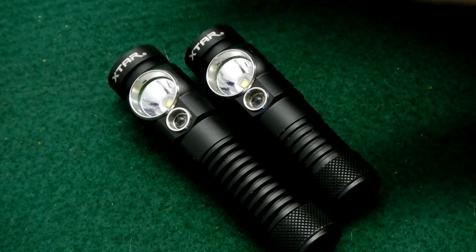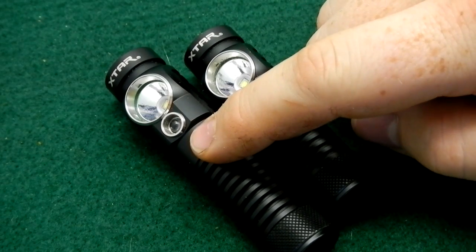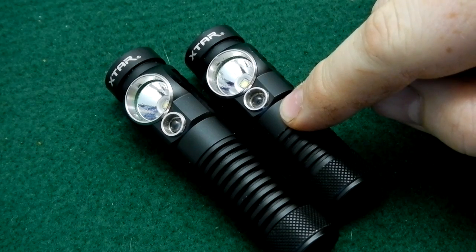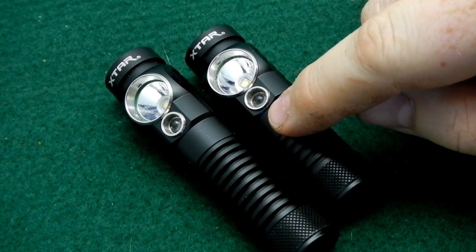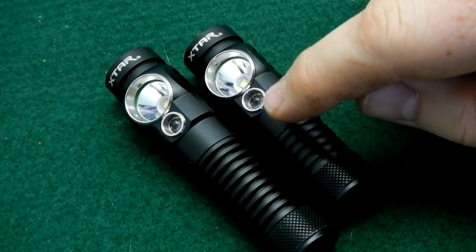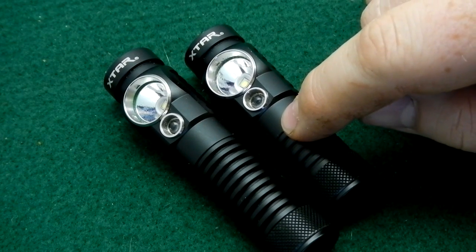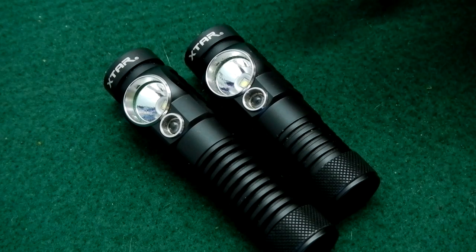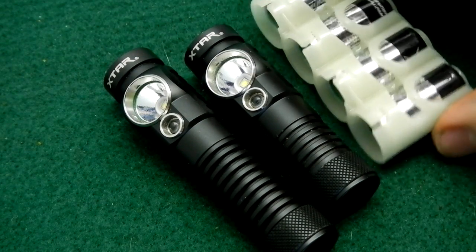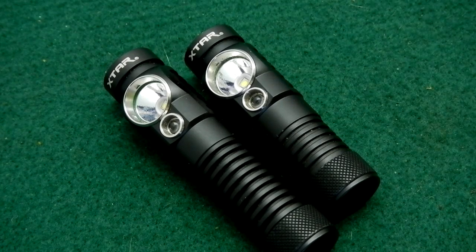As you can see, somewhat comparable. Instead of a standard alkaline at 1.2, 1.5 volts, the CR123 is a 3 volt system, so you're getting a little bit different run times out of it. And then when you go to the 16340, again, you get that turbo mode out of there, and it's just a higher drain usage. Depends on what you're going to run, whether you want standard CR123s or the rechargeables.